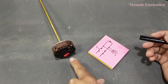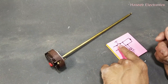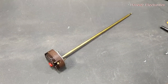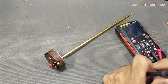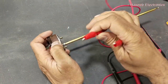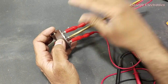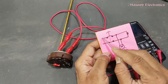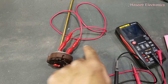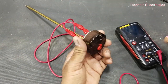When the temperature meets or exceeds our required temperature, it will disconnect the electrical path by opening this switch. If you are new to my channel, please subscribe and press the bell icon. For this demonstration I am using just a jumper wire to simulate the heater connection. We will connect a multimeter here — when the switch operates it will give continuity through this jumper wire, simulating the heating element. Set the multimeter to continuity.